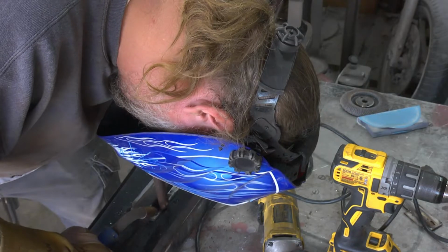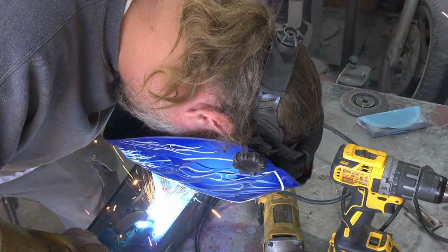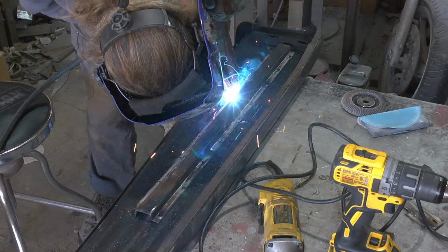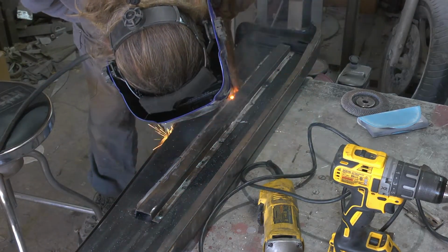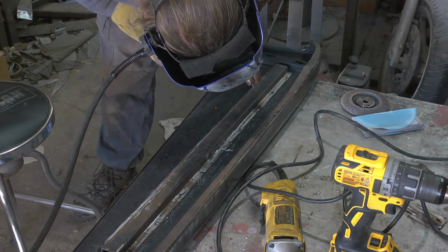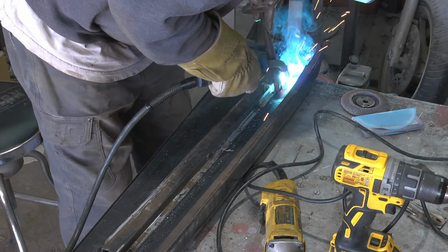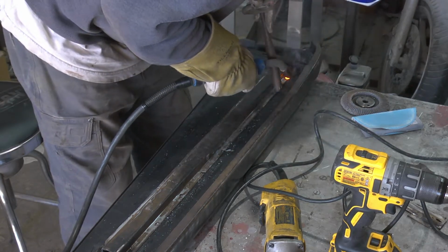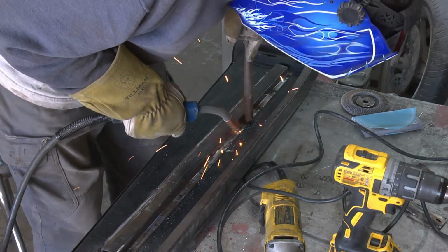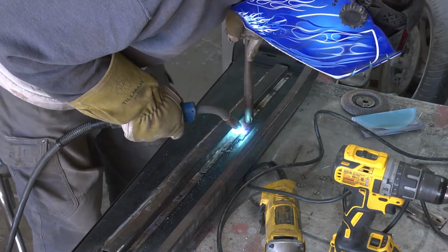I then had to clean off just the little individual areas where I knew I was going to be spot welding. Did that up good, and that's what you see kind of burning off there whenever there's a flame after I've welded a little bit. Once it was all welded up, go ahead and hit it with another coat of chassis black to seal everything up good and solid, and hopefully this time everything will be good and solid for more than 70 years.